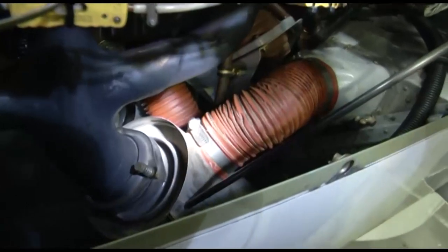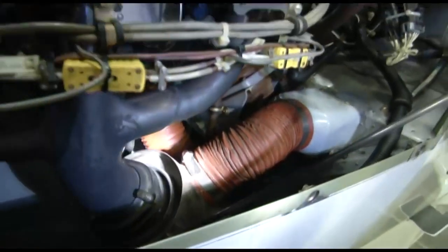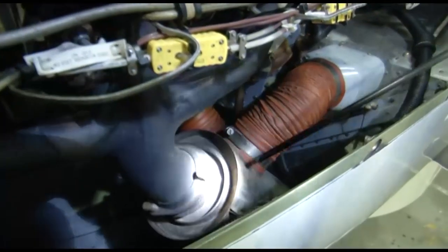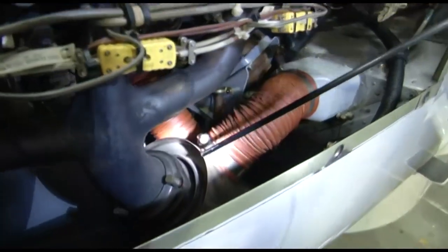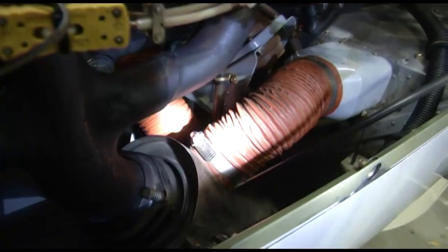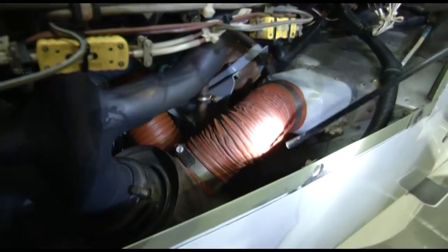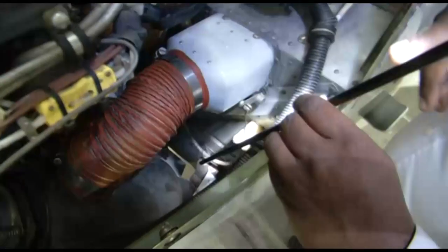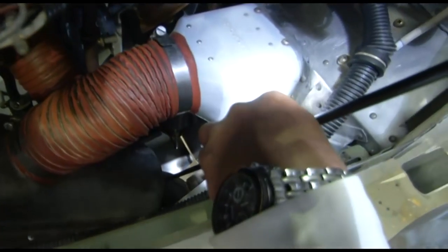These exhaust mufflers, we have seen in our slides, they are covered with heat shrouds. So these are exhaust heat shrouds, and inside is your muffler. The purpose of the heat shroud is to direct the ram air, the ambient air, to pass through these mufflers so that we can utilize the exhaust gases heat to heat the cabin air. Now this pipe, you can see here, out of the exhaust muffler, this is your tailpipe through which your exhaust gases are routed out of the engine.